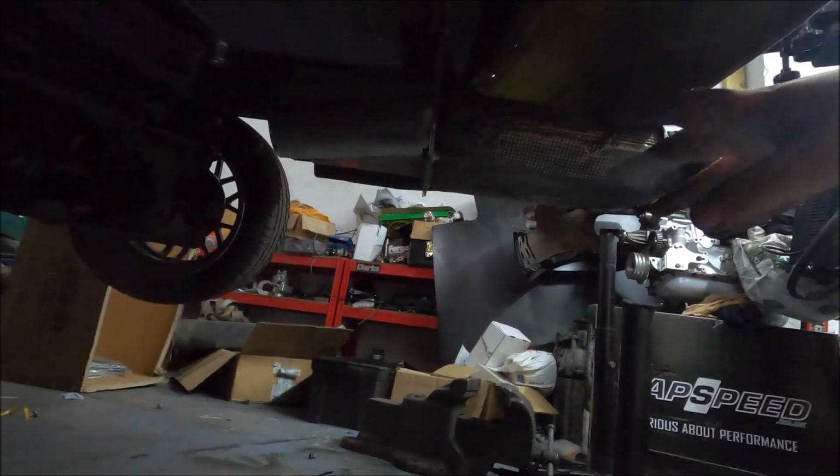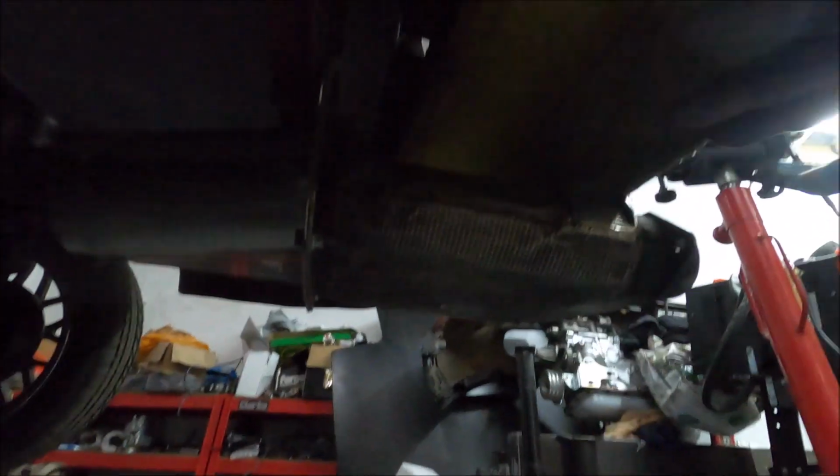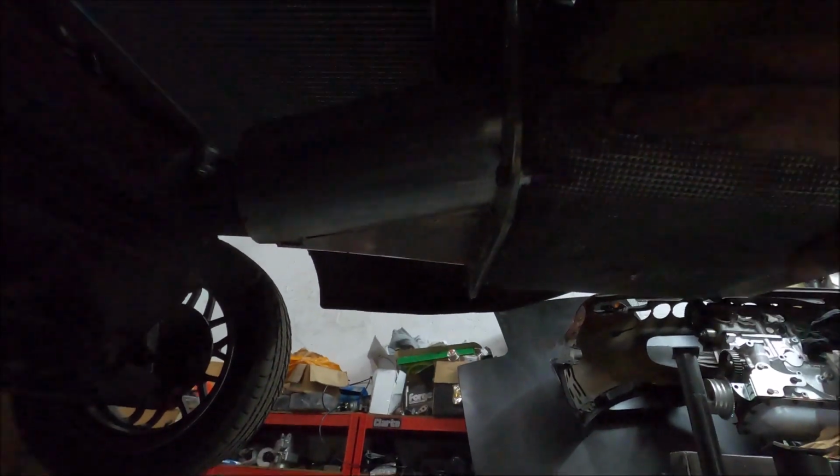So ideally bang on the back of it, because this is going to be tilted down maybe up to 45 degrees, I'm not sure, because with a bumper here it's all a bit guesswork, which would give more clearance. As always planned, it was center exit, but because of where the exhaust comes out on these, oh, you can't really see because it's dark and I brought the torch. Basically it comes out either side of underneath the diff, so the rear diff's in the way. So the pipe would have to be like 45 degrees and 45 degrees back. So I might not run it as a side exit, run it center exit in a more conventional place, so it's a straight shot exhaust without any bends. And that would give me more clearance as well, so I probably will do that.